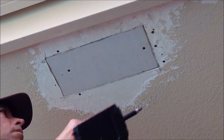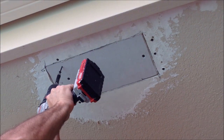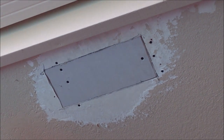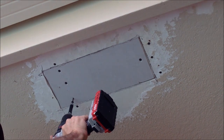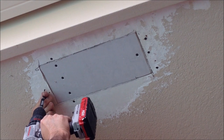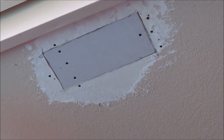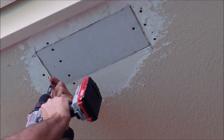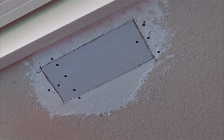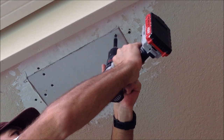Like I said, I had 16 of these - I'm just showing you one. No sense in showing all of them; it'll be a few-hour-long video. You don't want to break the paper when you put the screws in - you just want to barely go below the surface. It might be a little overkill with the screws, but I know it's solid and not going to move or crack.